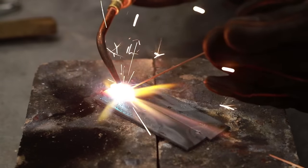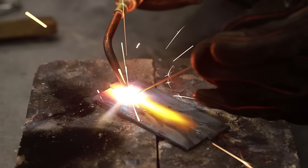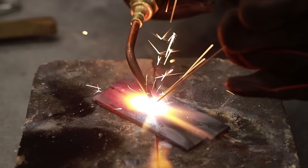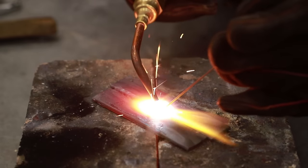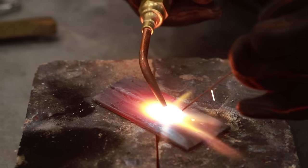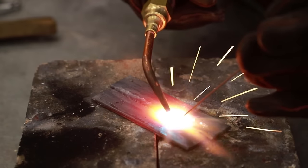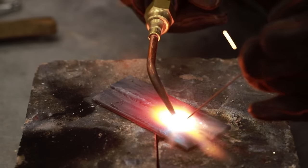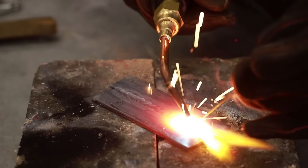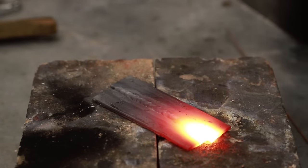All right, circle, dip, circle, dip. I'm going to take my time, really get that metal melted through there this time. Careful of how close you are so you don't get any kind of dip or flashback. Adjust your grip on your filler rod now and then to make sure you're not getting too close to the metal with your fingers. And we'll go nice and slow, nice big wide weld here. Acetylene, then oxygen to turn it off.